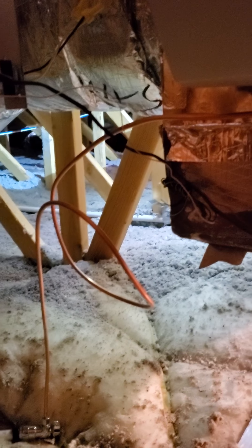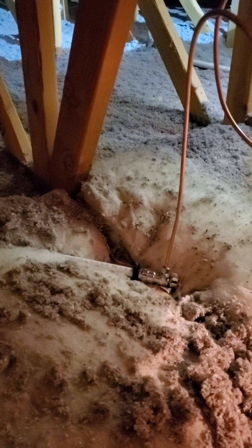I put a little reinforcement band just to keep some of the tension off of the fiberboard ducting itself. There you can see the plumbing - I'll go through this a little bit better. There's the copper pipe, quarter-inch OD. It goes down to my shutoff valve, goes into half-inch PEX, and I spliced in way back there to hot water.